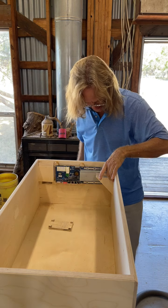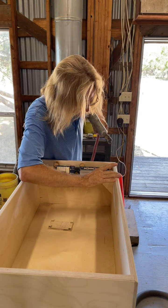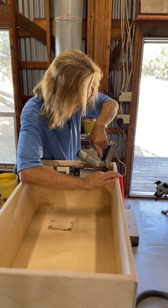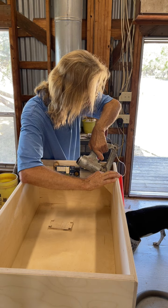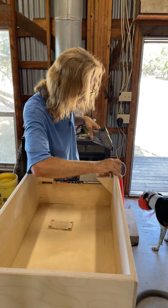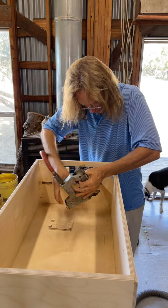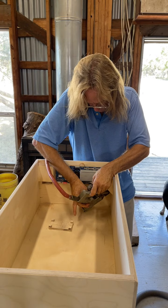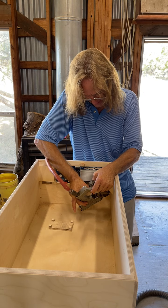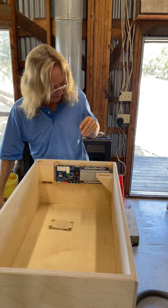So we just start with 1 nail right there. And then I just eyeball this, because again, it's not really critical that I make this perfect. Put a couple here. And that's a nice wet glue joint. So in the end, that glue joint's going to do all the work. As long as I put a few pins in to hold it snug so that it's tight when the glue sets off, I'll be good.